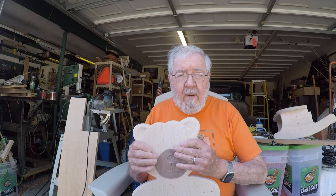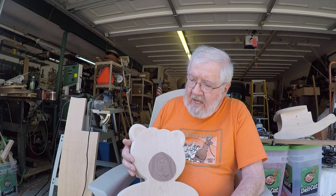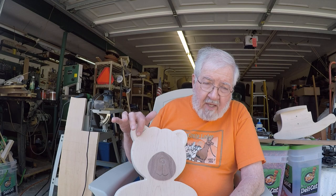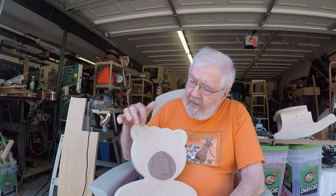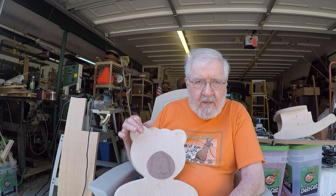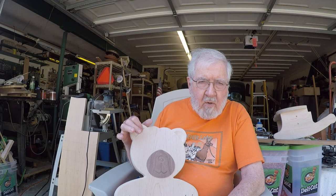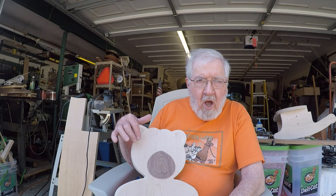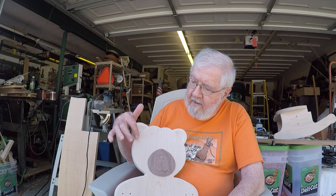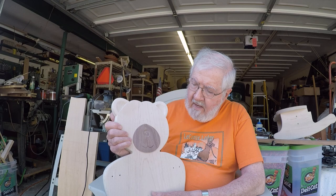What I'm probably going to do on this one is take some masking tape and cover this intersection so that as I apply finish to the outer part — which I think is going to create an amber shade — the hollow part of the ear will remain light. After two or three coats of finish, which in this case is going to be a mixture of boiled linseed oil and mineral spirits, I'll take that masking tape off. I hope that it will retain a contrast in shade between the rim around the ear and the inner part.